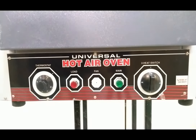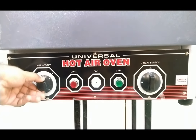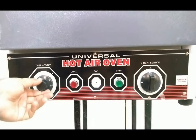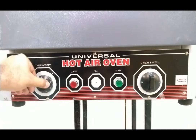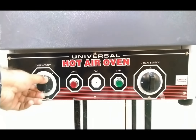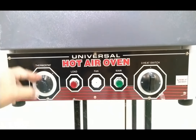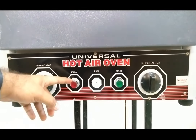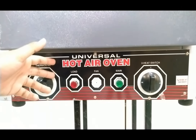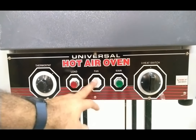This is the main control panel of this hot air oven or laboratory oven. This is the setting knob of the thermostat. At this point you have to set the temperature from 50, 100, 150, 200, up to 250 degrees centigrade. You can set this oven to any desired value with this setting point. Then we have the load button or load indicator — whenever the oven is heating and the heater inside is on, this will give you an indication so you can understand the heater has not yet reached the desired set value and is continuously heating the substance inside the oven.